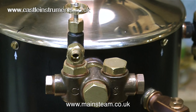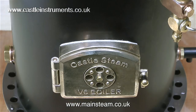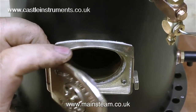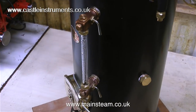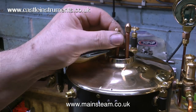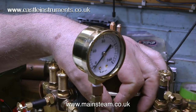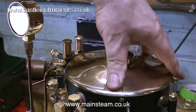Look at the quality of the fittings — this is a three-cock water gauge, and these are not cheap items. Not forgetting the superb fire hole door — it's a work of art. Not only does this beautiful fire hole door have an air vent at the front, it has a baffle plate so when you open the air vent to let some air into the fire, the baffle plate deflects the flow of air so it doesn't rush up the tubes and cool the boiler down. The design allows it to be a dual fuel boiler — it will run on gas or coal. I'm going to fire it using coal, so the holes in the fire hole door are very useful for letting air over the fire to reduce smoke.